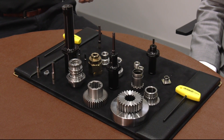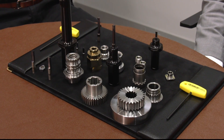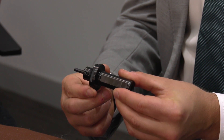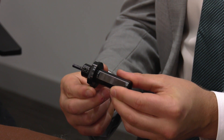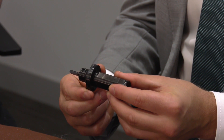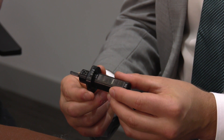How vast is the range? Horn is expanding the range continuously. Our standard range comes in three basic variations. Starting with the N105 system — this is the smallest of the standard range and it enters bores from around six millimetres. As standard we offer keyway broaching solutions, hexagon broaching for a number of sizes, as well as Torx and Torx Plus forms.